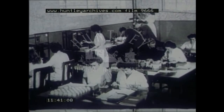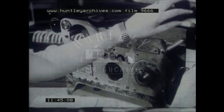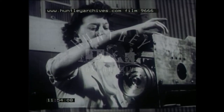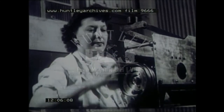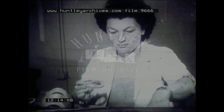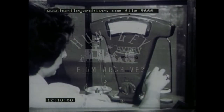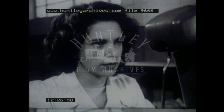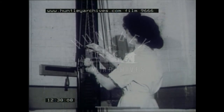Other tests are carried out in the factory laboratory. This machine makes an exact compression test for balls according to the Lawn Tennis Association requirements. This is a highly critical laboratory machine for checking compression; it's also used to check the accuracy of the routine factory tests that have already been made. This series of ring gauges establishes the exact diameter of a ball to within a fraction of an inch. Exact weight is determined on sensitive balances, and exact height of vertical bounce is measured on this machine that carries the ball up and drops it in front of a graduated mirror.